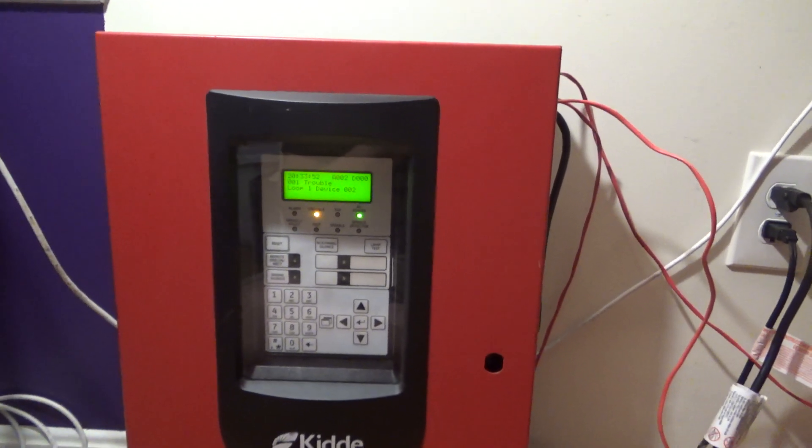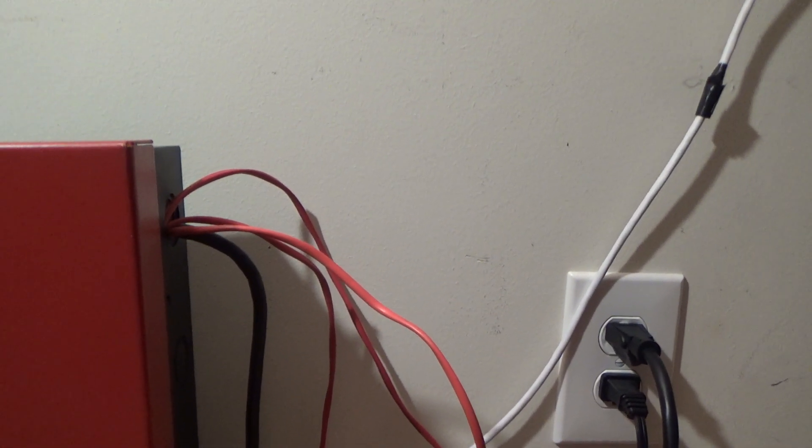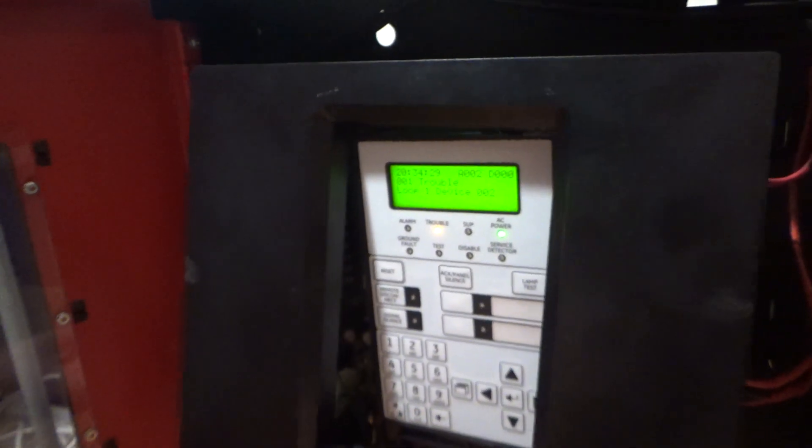The panel is the same. I have three sets of wires coming out. Let's open up this panel and take a look. I'm using two NACs again — NAC 1 is for the audible circuit, and NAC 2 is programmed for the visual circuit, because I'm going to show you the alarm in just a second. Actually, you already got a glimpse of it because I showed it in the video by mistake. But first things first, let me pop off the dress panel so you can see a little bit better.